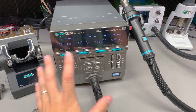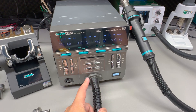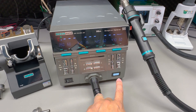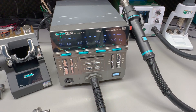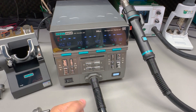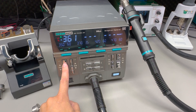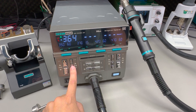Now for the front of the unit — this thing is massive. Starting with the mains on/off switch in the lower left corner — thumbs up for having that on the front. There's the hot air output silicone hose coming off the middle, and on the right side a mode button we'll explain later. Amusingly, the silkscreen text is wrong — it just says 'Moodle.' The user interface has temperature controls on the left and airflow controls on the right, with fine x1 single-step adjustment buttons and coarse 10-step up/down buttons.